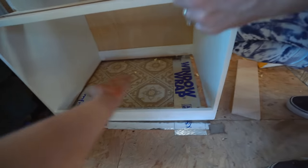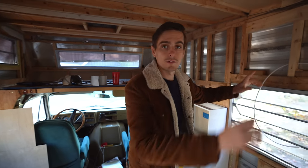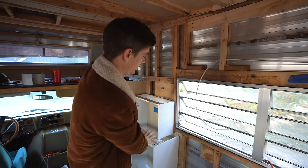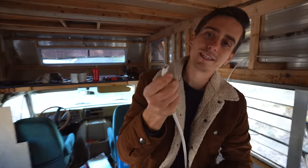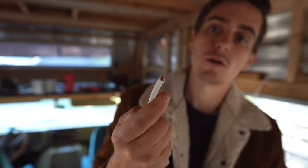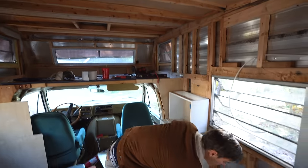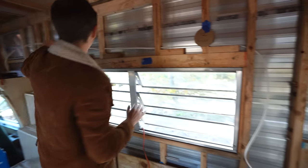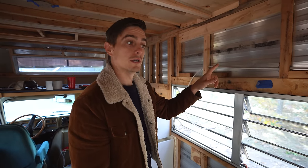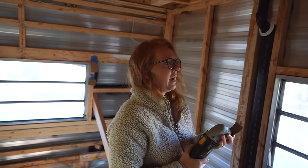It's the next day and it's freezing — in the 40s — but we're not letting that stop us. Our breaker box for all the devices is going to be mounted up in the cabinet, not down below. We're running duplex wire — positive and negative in one single cord — which keeps everything clean. It's all marine grade too, so waterproof and sunproof. We've started with simpler devices: the fridge wire is run through the wall up to where the breaker panel will be, and next is running 12-gauge wire to the two ceiling fans.